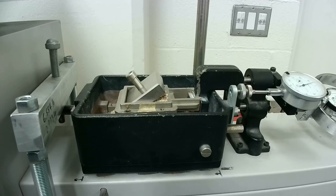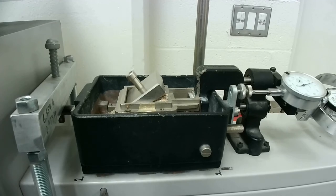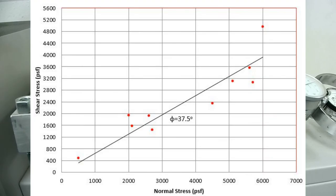After placing back the specimen to the original position, the next step would be to collect the sand that's inside the box and remake a specimen. This time, double the amount of weight or load that was applied to the specimen. That would be our second trial, and then our third trial would be to again double the load one more time and repeat the test. So in total, three times. The masses that we use the first time was 8 kilos, and then we go to 16 kilograms, and the last test is at 32 kilograms.